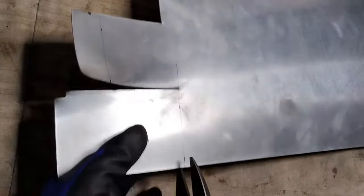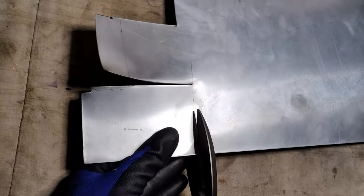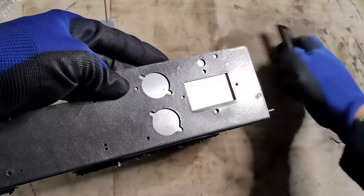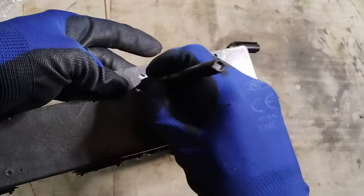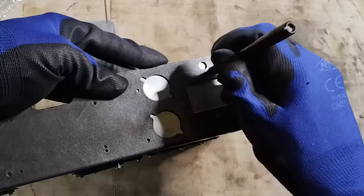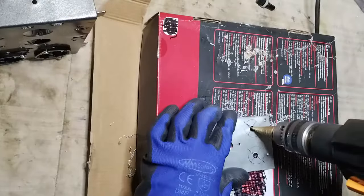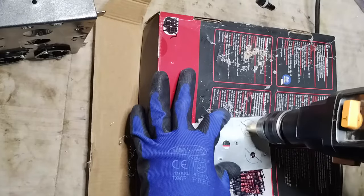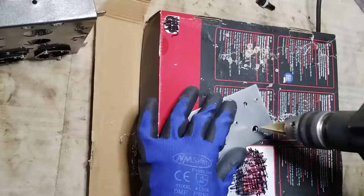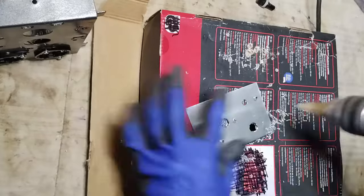A plate is prepared to cover the large chassis holes that are not used in the planned restoration. The largest hole is the one that was formerly the place for the input voltage selector, which will not be installed again. Other two holes are also there, and in this radio they were already left unused. This is a pure zinc plate, 1 millimeter thick, which can be worked easily with hand tools.